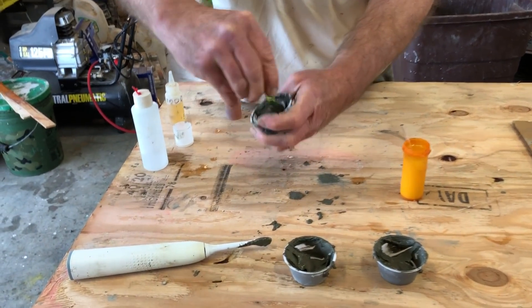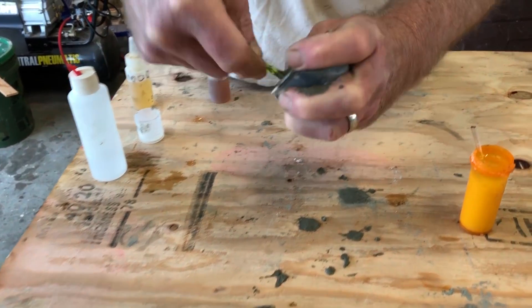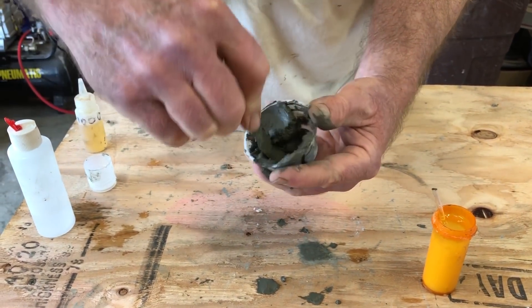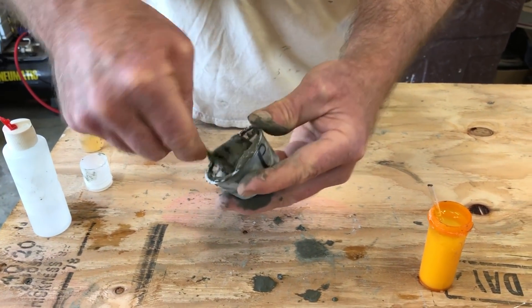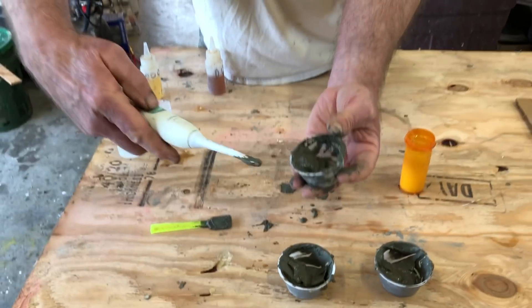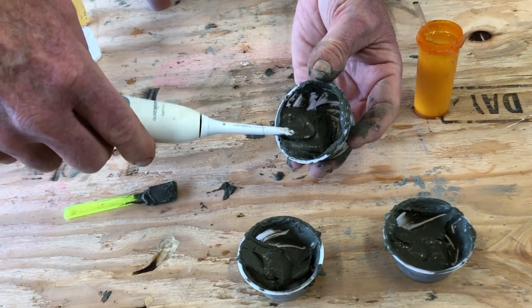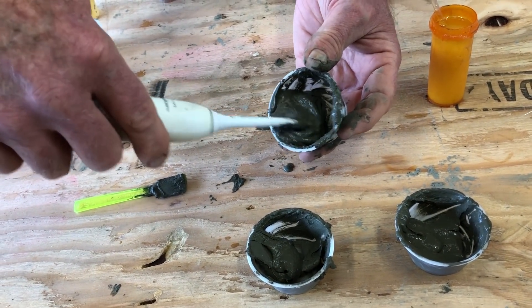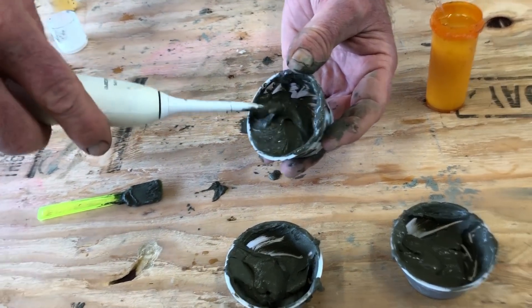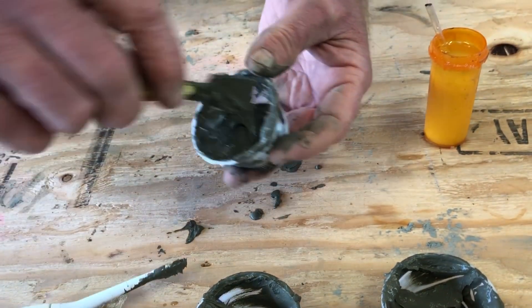And then with the PCE we find that it's a little bit stickier. This is pretty dry because the water content in this one was quite low — this is probably a water-cement ratio of 0.3-something, the low 0.3s. But it still will turn back into a mud puddle, just about as readily — not quite. And this one's gonna be a little bit stickier.